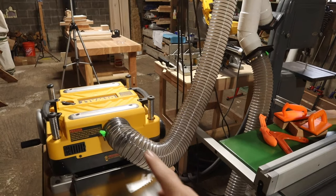So what you can do is put a canister collector on top, and that'll go a lot lower because you get way more surface area with the pleats. But you want to get a dust collector that you can use, because this is better than nothing. However, at some point I will be upgrading this to a much better system with a cyclone or a canister filter or something. So stay tuned for that.